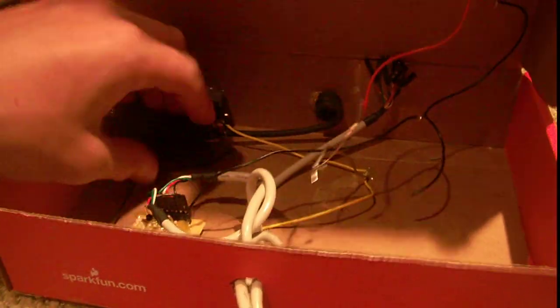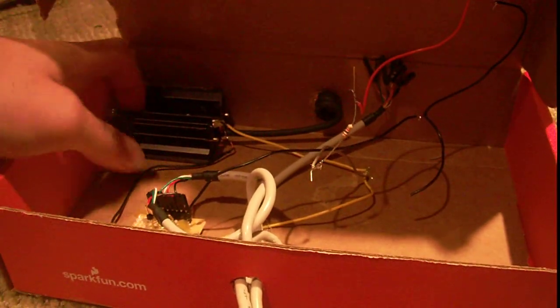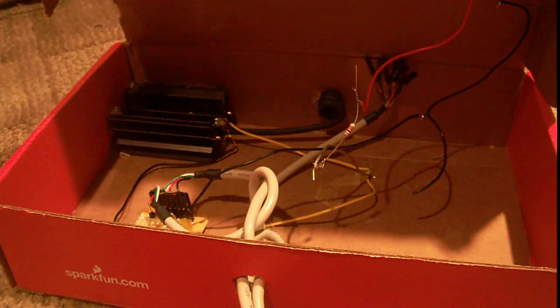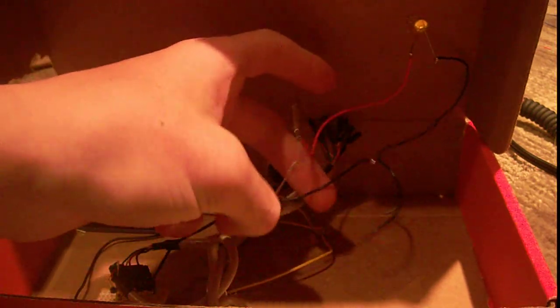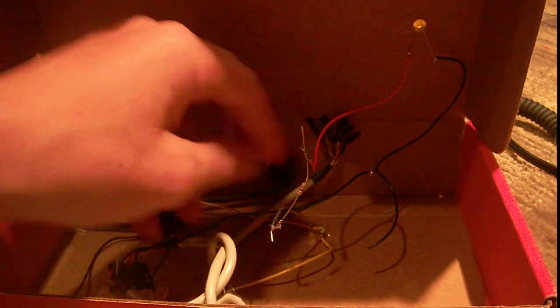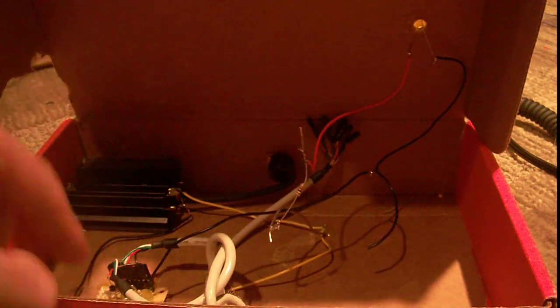This is the cable with the power coming in. It's connected to a 7805 linear voltage regulator, which is on one of these really big heatsinks typically used for heat-sinking MOSFETs. It's a 7805, so it does 5-volt regulation. That 5-volt goes out to this little LED — that's just a power indicator. What I plan to do is add one of those analog panel meters, but I haven't done that yet. The power and the ground just go to the LED, so now we have a nice clean 5-volt signal going to this board right here.